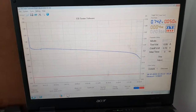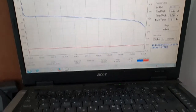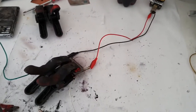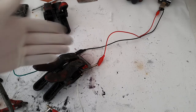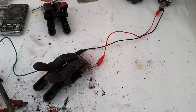Right now I am discharging this battery. I have over two hours of runtime on a 50 milliamp load and the energy of this battery right now is 110 milliwatt hours. I used 0.7 grams of active material, and the battery does not have any high cell voltage.